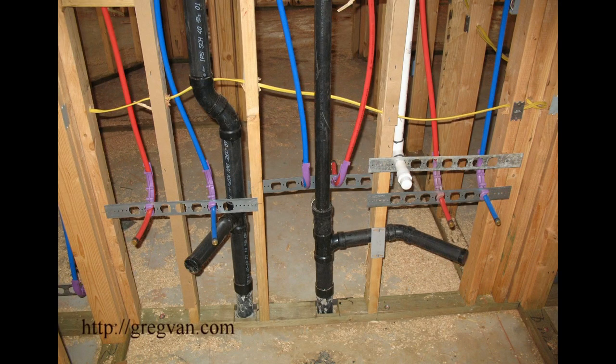My main complaint, of course, is the other picture we were looking at. If you have a gap between the pipe and the metal, you could put a piece of metal and slip it down in between there, or simply cover it — install it on the face, which would probably be the best way to do it. I was thinking you could put a metal plate between the pipe and the notch cut out of the plate. But that's not necessarily safe either — someone could drive a nail in at an angle and still reach the pipe at the bottom. If you would have put the plate on the outside, you would have never been able to nail it in the first place. So let's get rid of that idea.